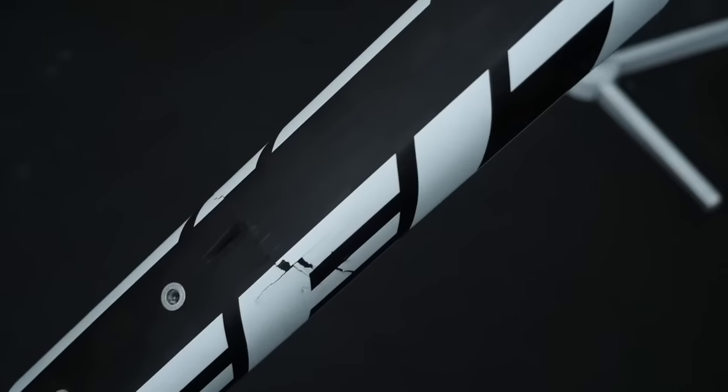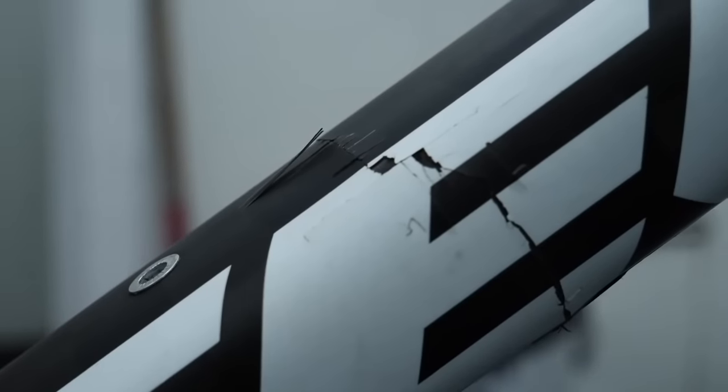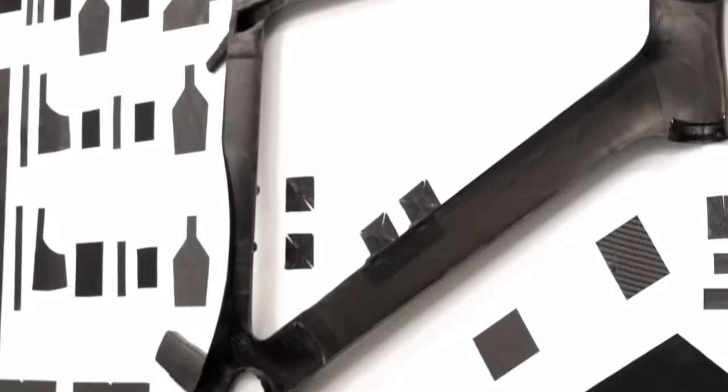So what's causing that damage then? So it starts off with very small fractures, micro fractures in the matrix, the resin of the material. If you're familiar with the term unidirectional material, you've got a unidirectional laminate with different orientations. If it's loaded at 0 degrees in tension, then a 90 degree ply will start to fail, because that's predominantly dominated by the matrix properties, the resin. So the resin is effectively acting in an unreinforced manner at that point.